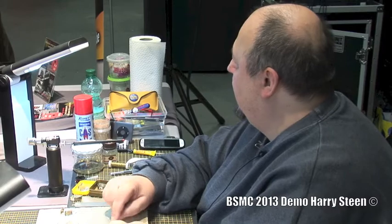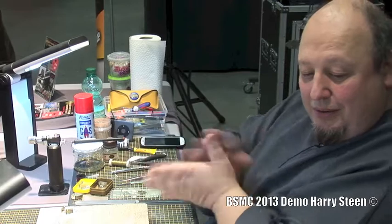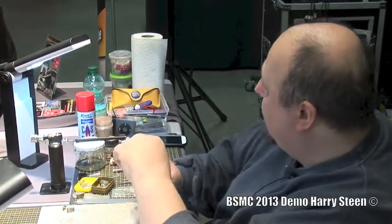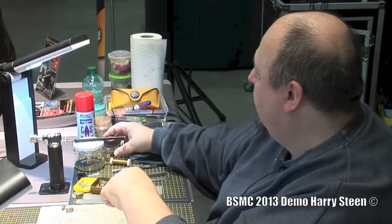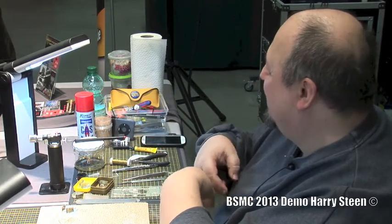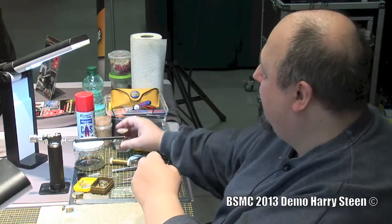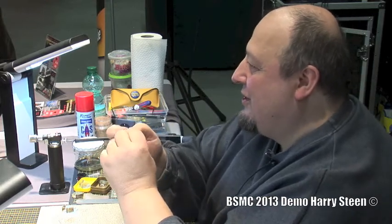Okay, the second key point is: heat the part, not the solder. Now, the flux I'm using here is acidic — it's like acid. So you have to clean your hands, don't touch too much of your clothes otherwise it may get holes. And you also have to clean the parts afterward, because acid is, in the end, oxidizing again. So after a while the parts will rust.